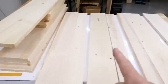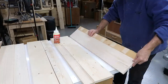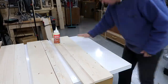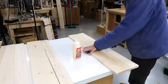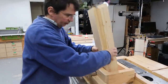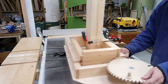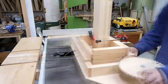One of my fronts is wide enough; the other four I'll have to glue together out of two pieces each. Next, I'm cutting some box joints into the back corners of the side pieces. As usual, I'm cutting these box joints with a regular blade, not a dado blade, because just taking a few passes with a box joint jig is fast enough.